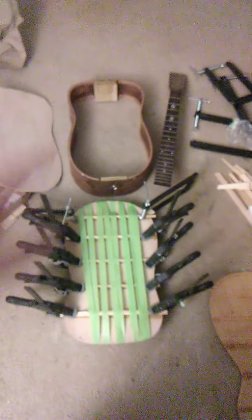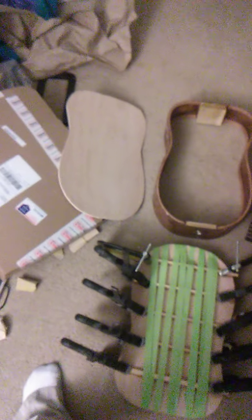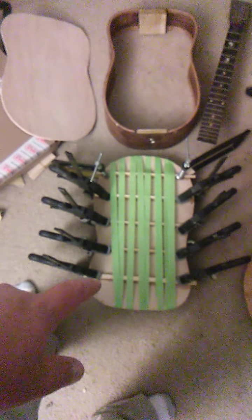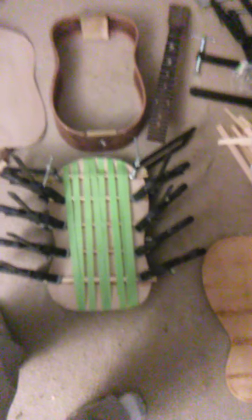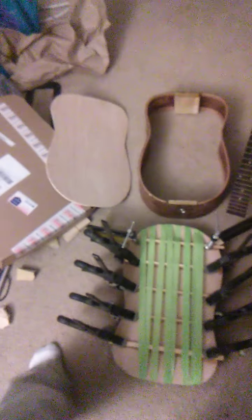As you can see, I got the sides already put together. I had that put together several months ago. And I took a piece of birch plywood, cut it with my jigsaw, and sanded it down really good. That's going to be the top — that is the bottom of the guitar — and it's going to be ladder braced with five braces, including a long bridge plate going across, like an old Harmony or Silvertone.